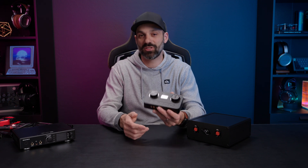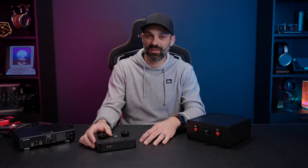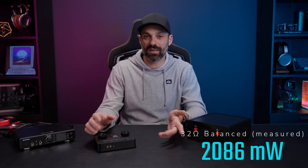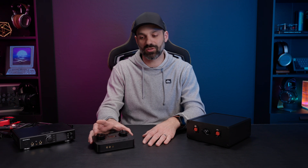Fosse claims 2.1 watts per channel, which is insane from this little device. I measured 2,086 milliwatts — just under 2.1 watts — which is so close to the margin of error that it's dead on with what the manufacturer is claiming. That's great; not all manufacturers hit this, and in my early testing some already didn't match.